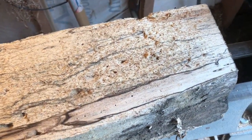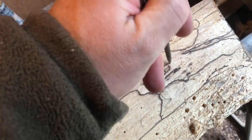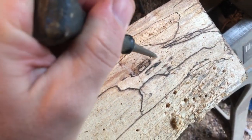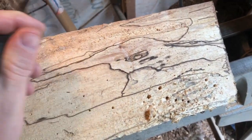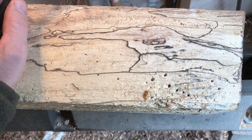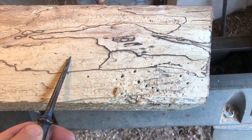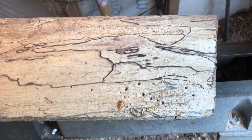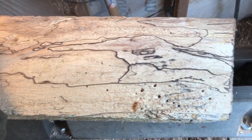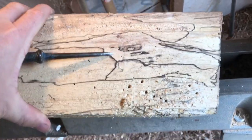The other thing is that when you put finish on it, spalted wood absorbs finish a lot more aggressively, so it'll be a little more yellowing because it absorbs so much. Spalted wood also seems to come out a lot lighter in a lot of cases. You get a little bit more yellowing with things like Danish oils and tung oils, but by and large I treat it just like everything else I do.